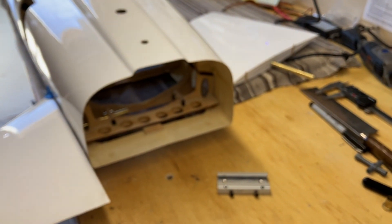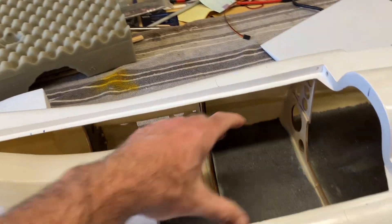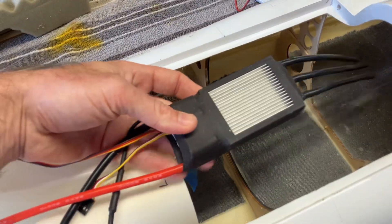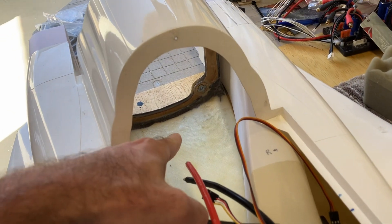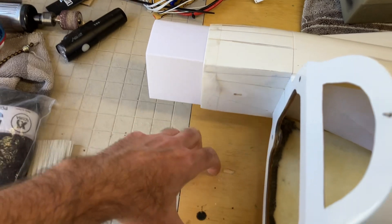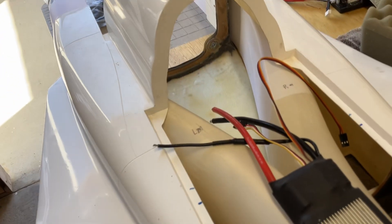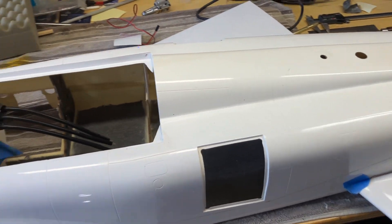So now I've got to get busy on getting these plugs ready, and I've got to design the rest of the intake, which will be pretty simple other than incorporating a holder for the ESC — which will probably go about right here near the CG. I want to keep the leads pretty short to the batteries. It's likely one battery will go in the forward belly between the intakes, and the other two will probably go right here below the cockpit. We'll see how the balance works out, but that's where I originally mocked everything up and it balanced pretty well.